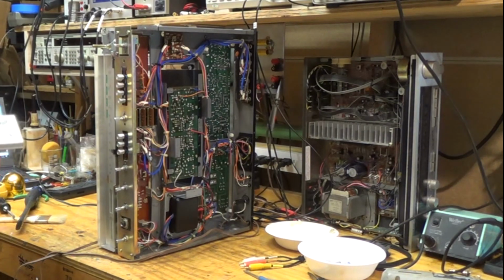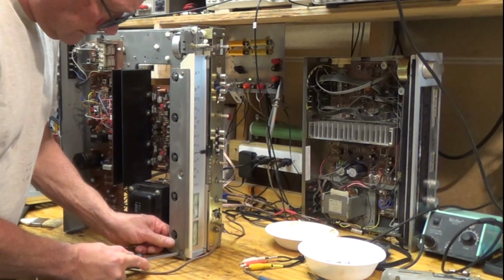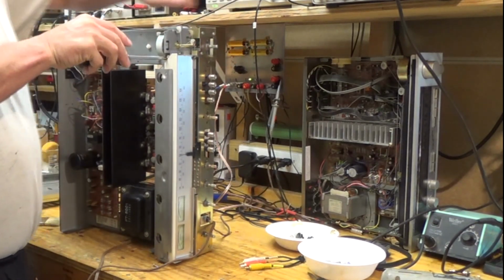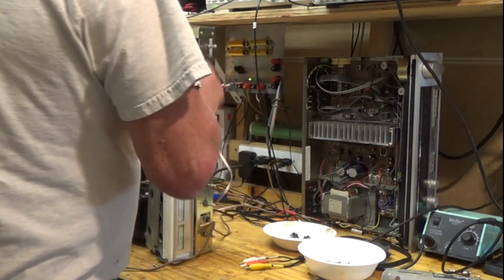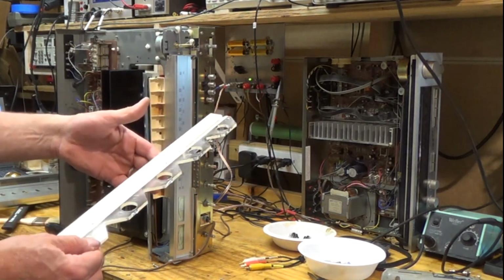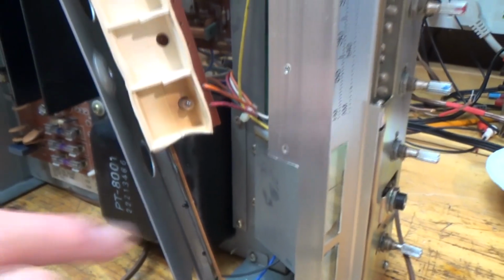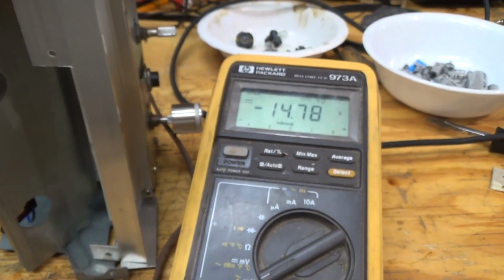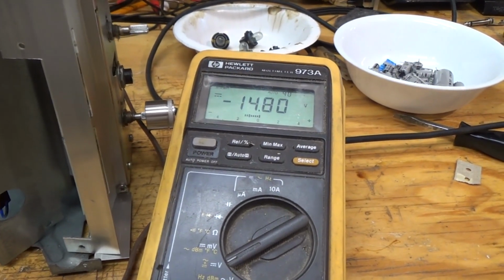Wow, that couldn't be easier. Then, let's try. So there's our stereo bulb, and they're soldered in from the back. So when I'm on a stereo station, I'm at 15 volts, so I'm gonna see how an LED would be in there.